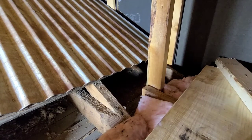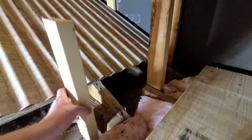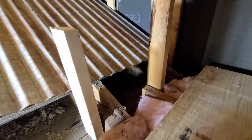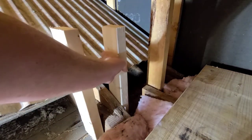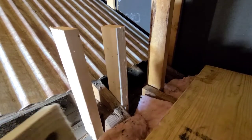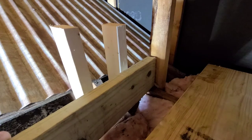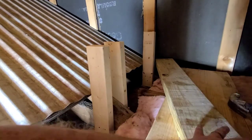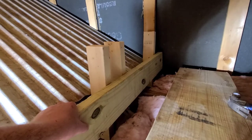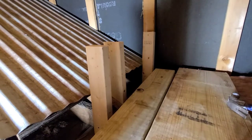Now that I got some soldiers cut, I can show you what we're planning on doing here. This is a soldier — it will be fastened to the outside of this rafter, and we'll fasten another one to the outside of this rafter. In place of the 2x12, for demonstration purposes, it will be placed right here. With the soldiers in, that gives us a place to fasten the first 2x12 to and to pull the load from the beam into the 2x12. We're going to continue this all the way down this wall. Stay tuned.